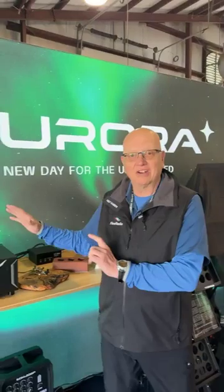Now that we've got this all in one box, how many of you go to your summer house and you've got to drag the radio, the amplifier? You don't have to. This will actually do carry-on luggage if you're on a DXpedition or a mini-DXpedition — maybe just a vacation where you're going to operate for some days. You can take 500 watts in one carry-on bag because it runs from 84 volts to 260 volts AC. It's not designed for DC, but we've had POTA discussions where people said if they have to, they can run it at 500 watts with just a little Honda generator, which sips fuel so you cut down on weight.